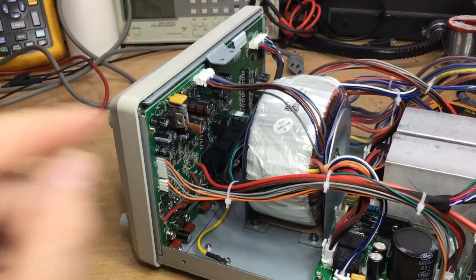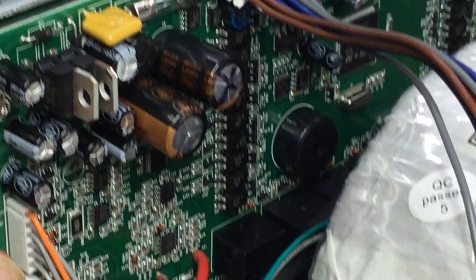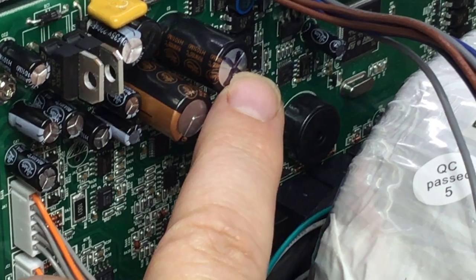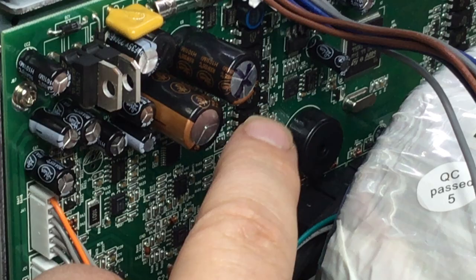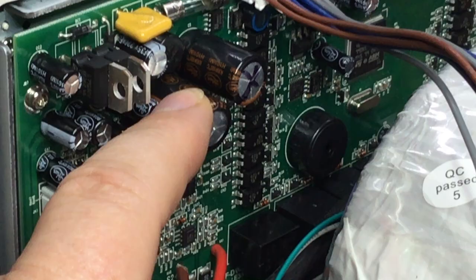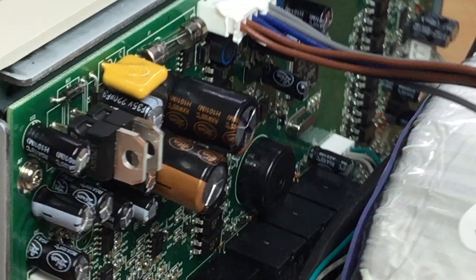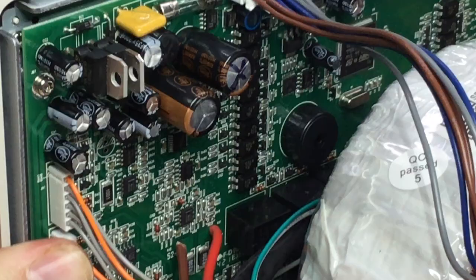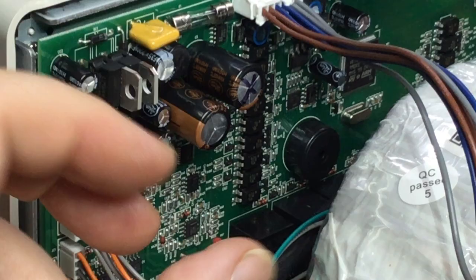It splits, does that little protective cap, these little split caps on the tops there. They're normally all puffed up, and then they literally just open up like a clamshell, and you can see all the internals, and they can vent off this cloud of ammonia-smelling smoke or steam. So there's no sign of any capacitor deformation there, so I would presume that would be down to the capacitor being on its way out. Luckily it didn't explode, because it can make a bit of a mess when they go off,